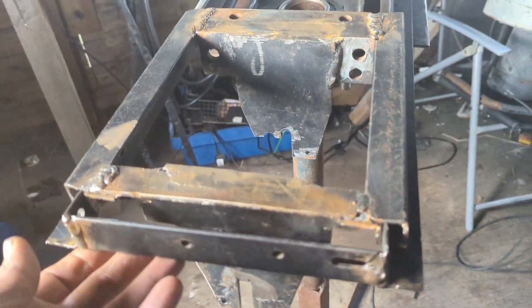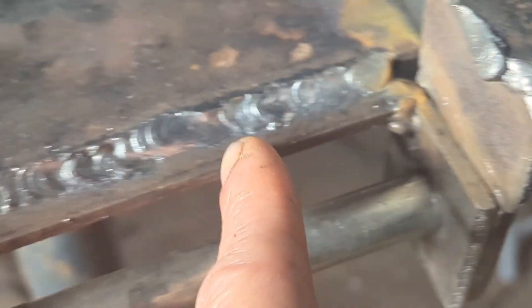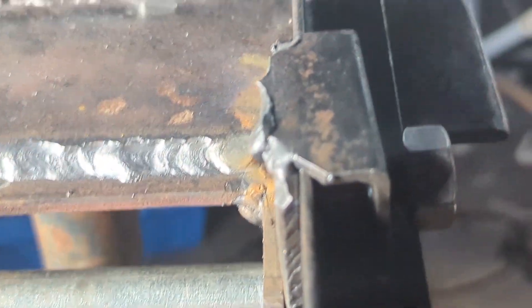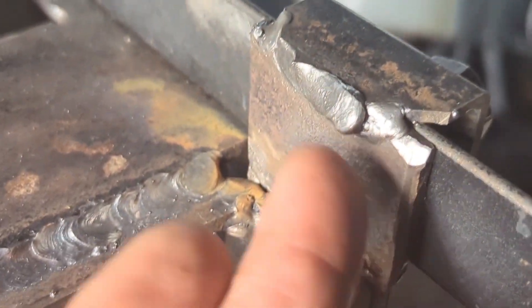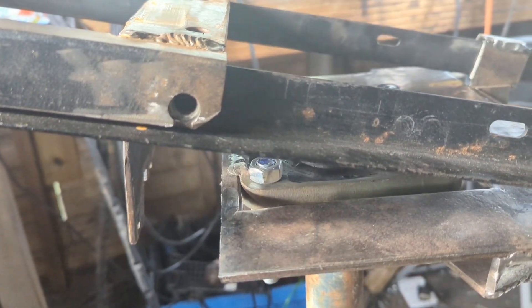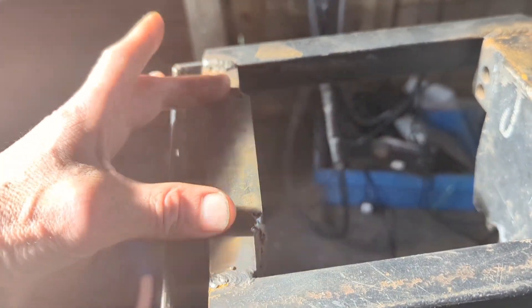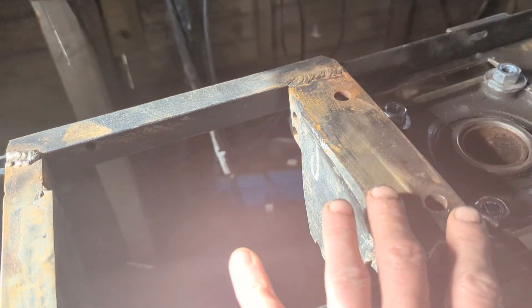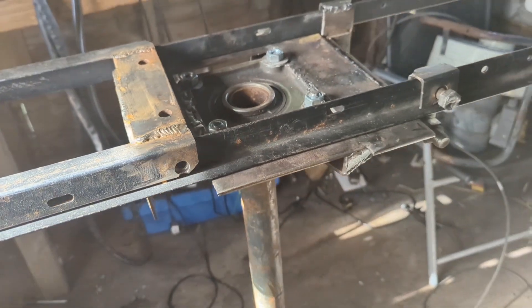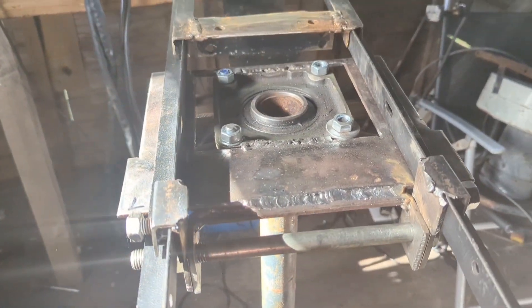Greetings YouTube — this is progress I think. I just want to show you the hinge and tell you what's good about it and what isn't. The design of the interior bit — this plate welded onto these two — is perfect, absolutely no problem at all. Lined up pretty well, super strong, no problem there at all. This is the problem: I was planning on using these bolts to tighten up the bracket. This obviously will have supports here which will hold it up at the right angle — it's not just going to be relying on that bolt to hold it up. I've got the motor in the front and I'm planning to try and install the bearings directly onto the top of the motor casing either side. I kind of regret making it shorter because it was about a foot longer, but I think it looks pretty cool and the function of the hinge will be great.